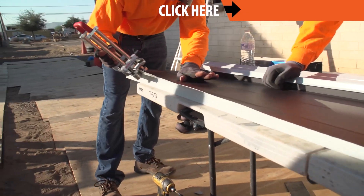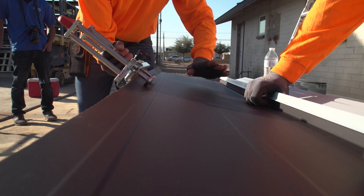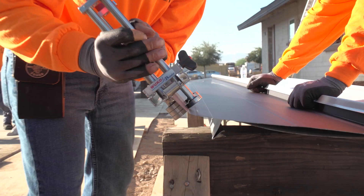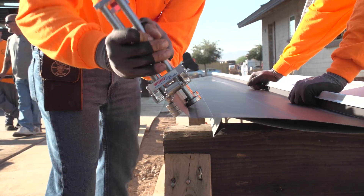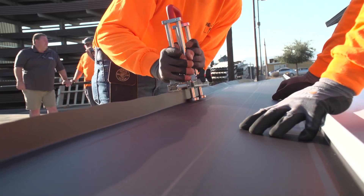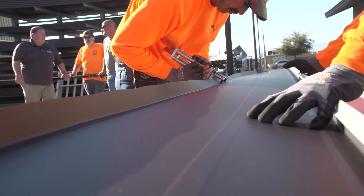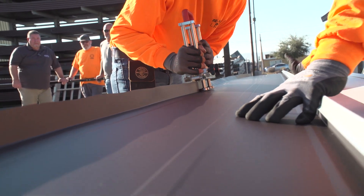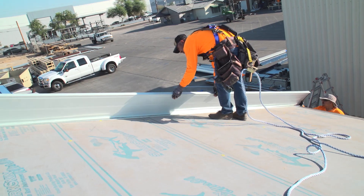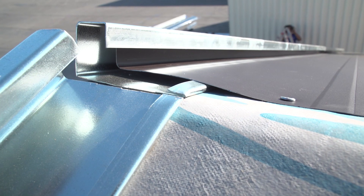There are various tools used to fold the 1 inch seam — we are using a Waco Bender. The tool is simply adjusted to your desired depth, then roll the tool back and forth along the panel while gradually bending towards 90 degrees. It's best to roll the tool along the entire length of the panel as you slightly start to bend. Once the panel is ready, it simply slides into the receiver trim at the gable end and is fastened with clips.